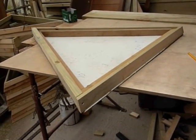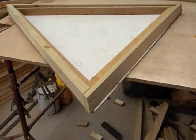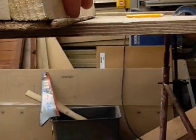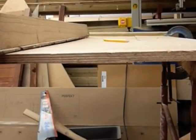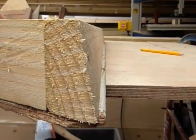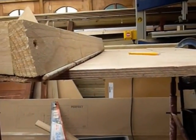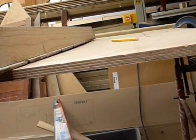Let's take a look at building the tunnel triangle frames. We've done the dome ones, and we typically have the angle that goes on all the frames to make the dome. The tunnel ones are slightly different — we have an angle, same as the domes, that goes thin at the top and thicker at the bottom. We put all our frames this way on all the triangles. You'll notice on the plans that there's a negative angle.